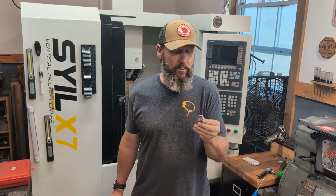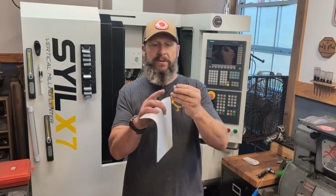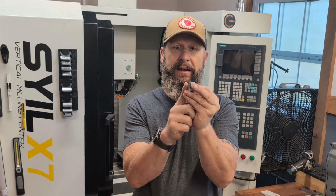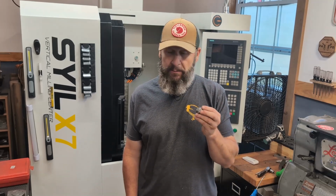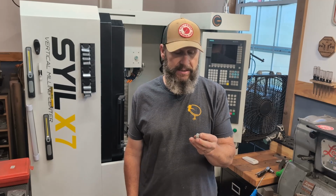No matter how much Teflon tape I put on here, it leaked. So I ended up buying a new one, something with longer threads. Longer meaning they had more thread length from start to finish. Once again, I tried with Teflon tape. It leaked. I tried putting more Teflon tape on twice, and it still leaked. It seeped out. In the end, I went with pipe sealant.